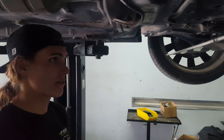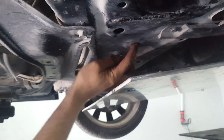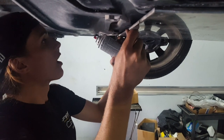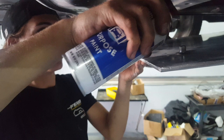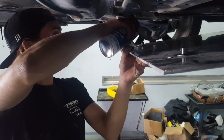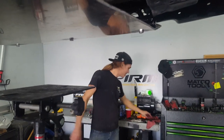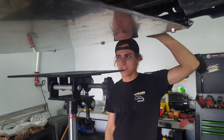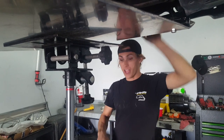I'm putting the rear mounting points for this skid plate. Basically, how I do this is I find some holes that are up in this subframe, and then I set the weld nuts on top, and then I just push this up and go — okay, they land somewhere inside those pre-existing holes. And then once again I take spray paint and mark the holes. Then let's take everything apart again. It's like all I do all day long is put stuff together, then take it back apart, then put it back together, then take it back apart, then bang on it with a hammer, and then put it back together — and then I'm like, it's custom.